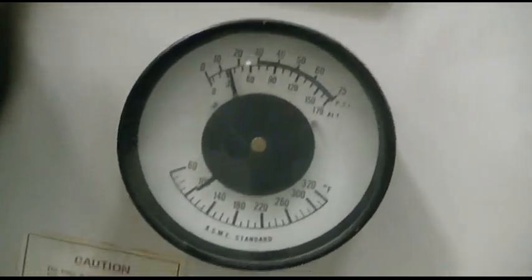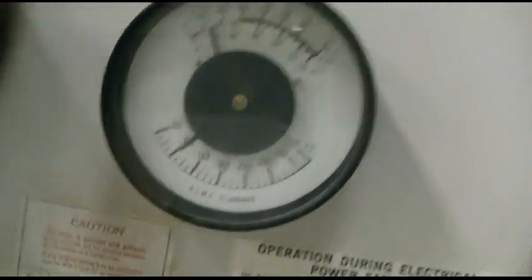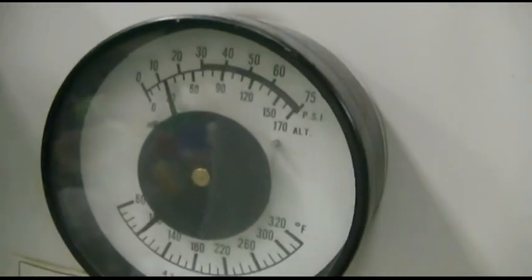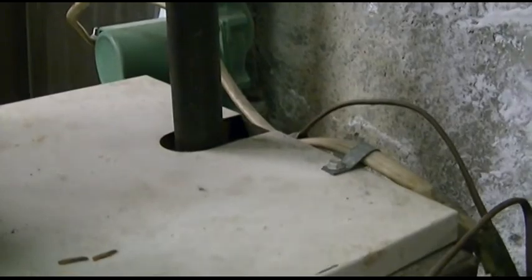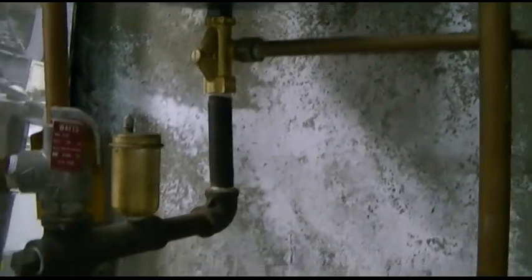A problem with this boiler is that I can't get enough pressure into it. The gauge is reading about 12-13 PSI right now, and the temperature is down because nothing's been running. I can't get any higher than that. When I refill the system, I do it via the valve that runs down this pipe, bends around, and goes into the expansion tank on top, then down through the air purger and pressure relief valve into the boiler. This device limits it to about 12-14 PSI, which isn't enough pressure to get through the entire system.